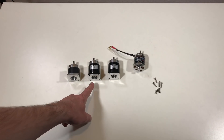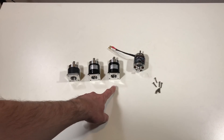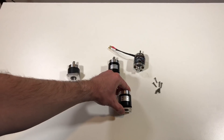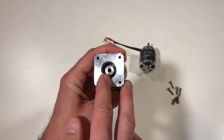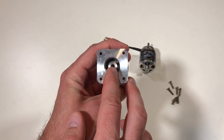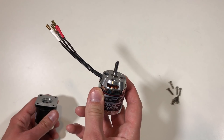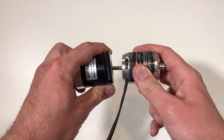Today I'm going to use the gear ratio of 30 — because it's just in between 40 and 10. Fortunately the input shaft is made for a 5mm diameter shaft, and this motor has exactly a 5mm diameter shaft, so they can go together.